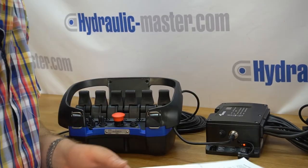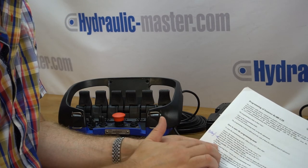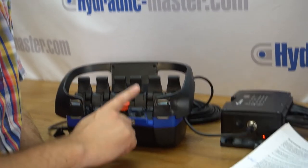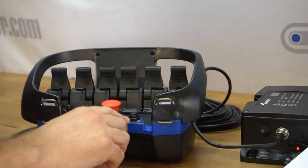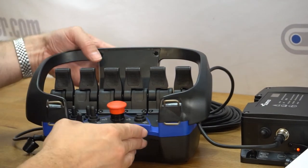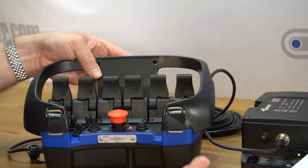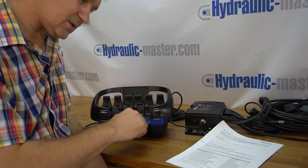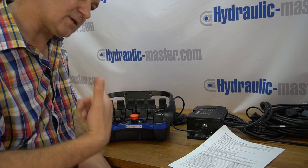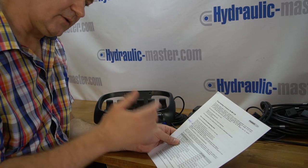So as I explained, you need to hit the start on-signal button and then within five seconds do the joystick — knock it a few times. What's important to stress here: the instructions just say press it, but actually you need to press it probably for a second and wait for the red LED, and then straight after start hitting the joystick to the right. Let's see — LED, and then you get the tone. So it's really important: press, wait for the light, then quickly do the joystick. Now we get a constant tone — that long beeping sound means you are now in programming mode.